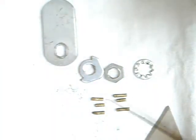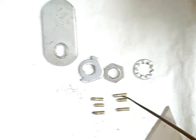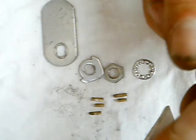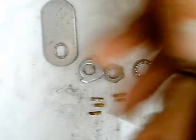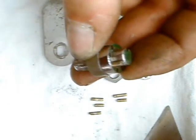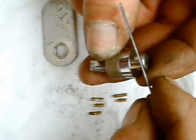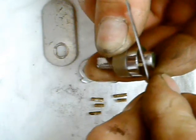Now, if you look, these pins right here — these are what determine whether or not the lock's going to open or not. Each one is a different size. What you do is you put these in; this is a little easier. You put them in just like that. Each pin is going to go in. This one was a longer one — as you push down, it only goes that far in. That's the farthest it'll go in.